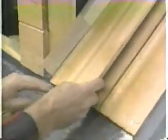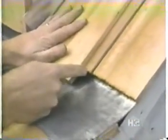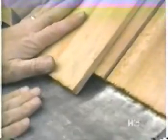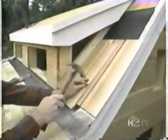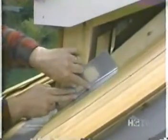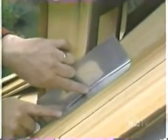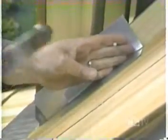Now I can place the shingles over it. Now this first full course, I'm going to extend down beyond the butt edge of the shingles underneath so that it'll help hold this flashing down. Plus it'll look a lot better. After I install each course, I want to put in another piece of step flashing, making sure to hold it up high enough so it's just above the new course line.